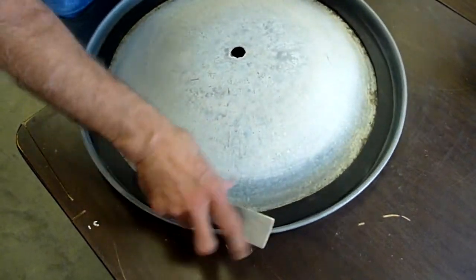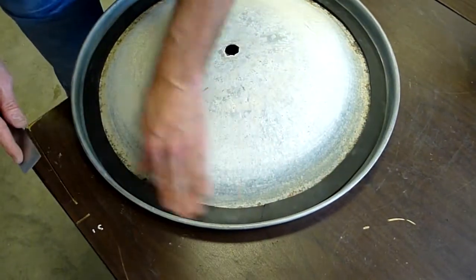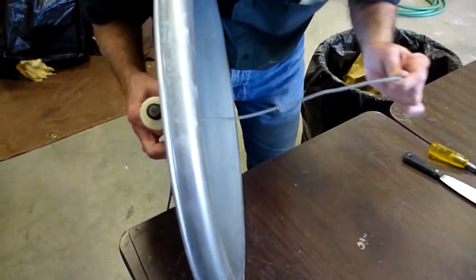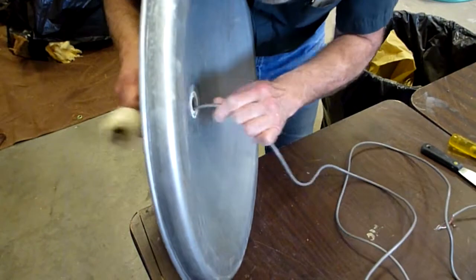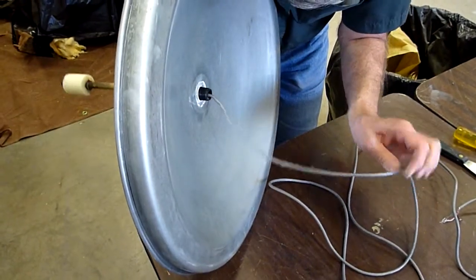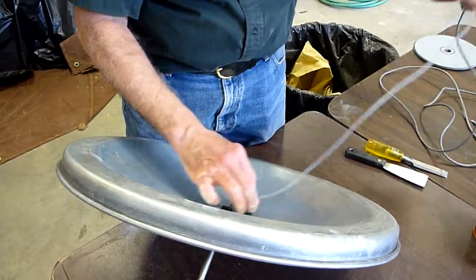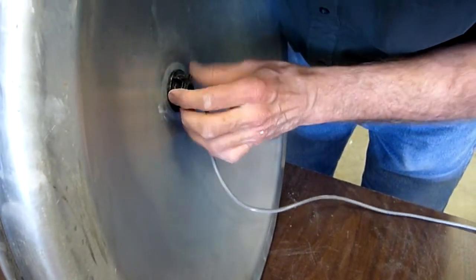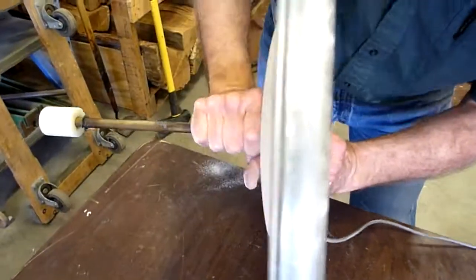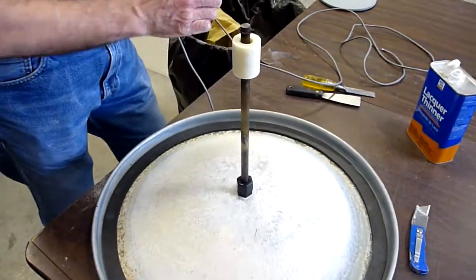Take a putty knife or other utensil and push down firmly all the way around the gasket to ensure good contact between the manway cover and the adhesive. Then reinstall the float sensor and stem into the manway cover. Take the nut, put the wire through, and tighten the nut onto the sensor stem. Hand tight is perfectly acceptable — there's no reason to use tools here. Lastly, ensure the float still moves freely and reinstall.